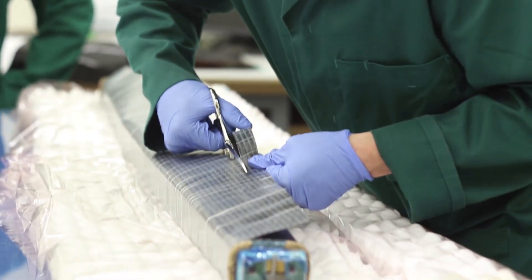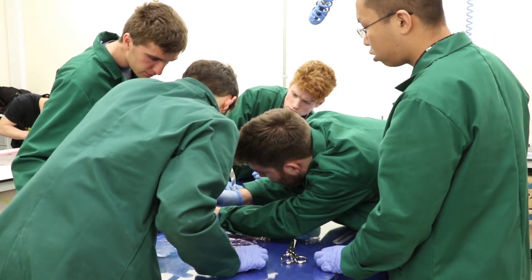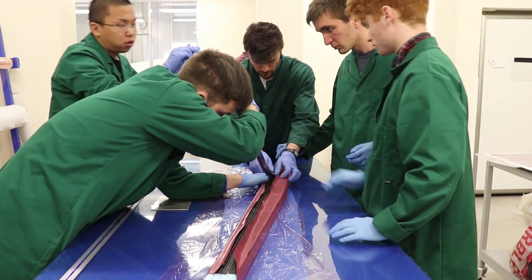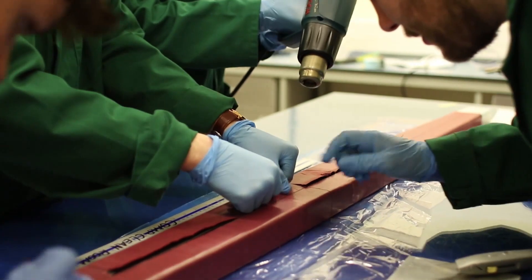At this moment we are manufacturing a composite beam. For doing that we need to have a mould wrapping from the outside, to get a break from the things that are inside. The mould that we chose is a sand model because it's very easy to dissolve. Finally onto the lay-up — the way we're getting it to meet on one of the faces is we put down a metal shim and then lay up around and overlap it slightly and cut it so that we can get a nice joint.